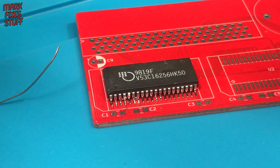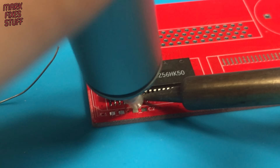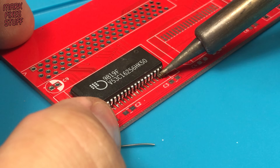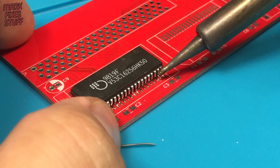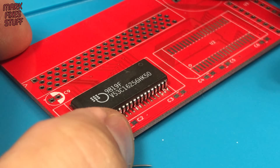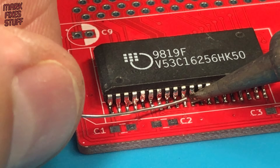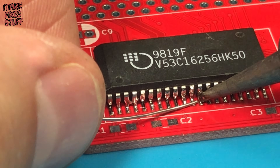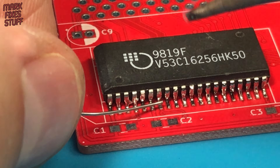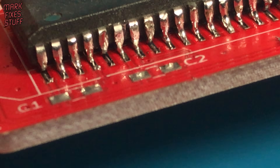I'm using the amazing SS02 solder sucker with the high temperature silicone tip — highly recommended, my affiliate link is below. Who doesn't love suction? Now let's switch to my usual hand soldering technique. With the solder pre-loaded on the tip, I touch the component leg and solder pad at the same time, drawing it back out towards myself. The solder usually flows between the heated pad and leg without bridging other legs. If a bridge does happen, we can easily clear it with the solder sucker.